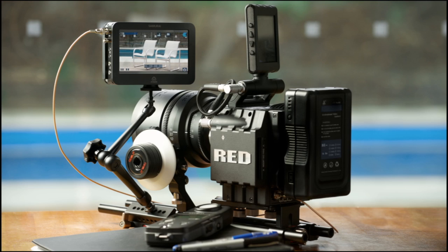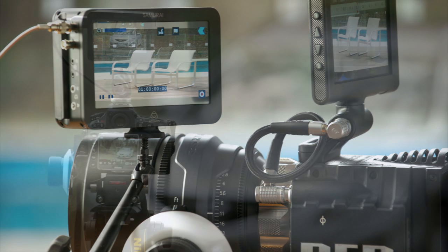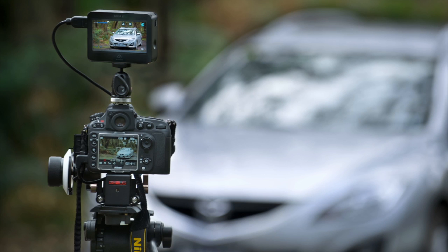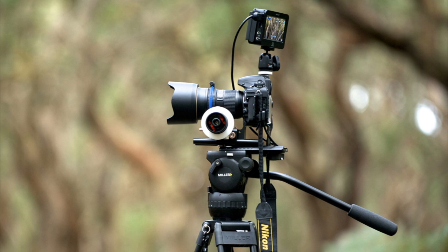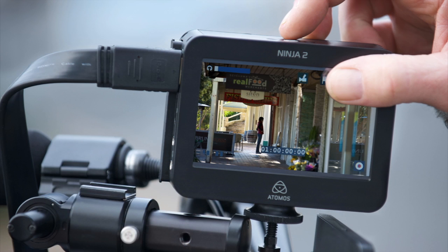Most video cameras and DSLR cameras record internally to progressive formats and actually output the video signal over SDI or HDMI as a part of an interlaced signal. They do this in order to be compatible with a greater number of monitors and displays. This process is referred to as applying pull-down or telecining to the video stream. The Connect converter can remove this pull-down, or apply reverse telecining, from the incoming signal to extract the original progressive video frames.